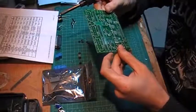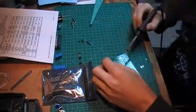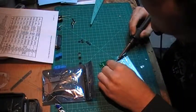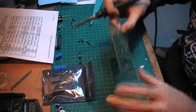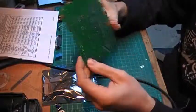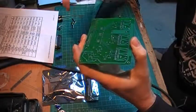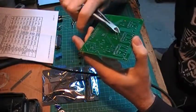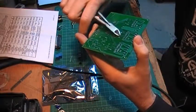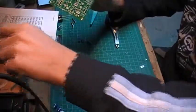I'm just inspecting the soldering, making sure the leads went through both sides of the board. If you have a solder joint you don't like, you can just go back and add a little more solder. So I've got these three resistors in place. Now I'm just gonna cut the excess leads — I'm using little pliers, you don't want to damage the board — and then I'll keep going with the other resistors.